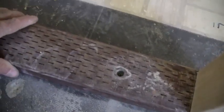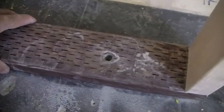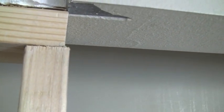that you can see that all the nailing's done. Here's the exact same application as before. A nice pressure-treated base with one anchor within 16 inches from the side, five nails in the trim stud. The header stud has three nails. The king stud, well, unfortunately, we came off just a little tiny bit to get level, but she's nice and level, perfect, ready to go.